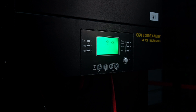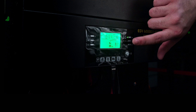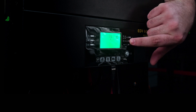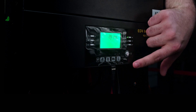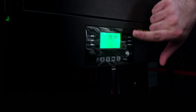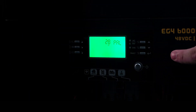Now we need to repeat these steps for the next inverter. For our slave inverter, we're going to hold the enter key and go into the settings. Go back down to setting 28, and then once there, click the power button to put us in standby. Press enter, and now you can select what you want. We're going to be on parallel — P-A-L — and lock it into place with enter.